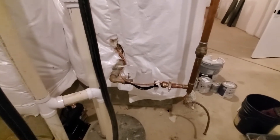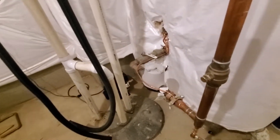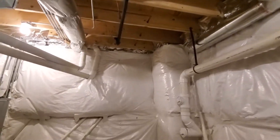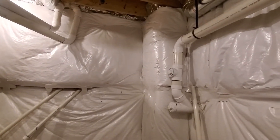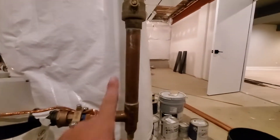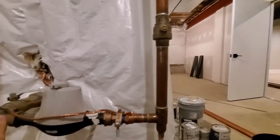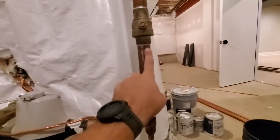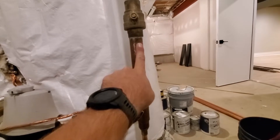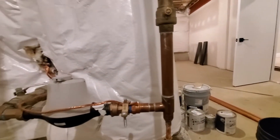In our area, some of these towns have pretty terrible water pressure, so we're going to be putting a booster pump in. We'll tie in here, put a valve, run it over, up, and out. I typically try to tie in before the second ball valve — you can see you've got one there — so that if you ever go out of town, you can turn your house off but leave your irrigation on to water in the summer.